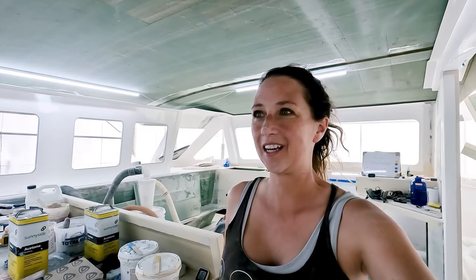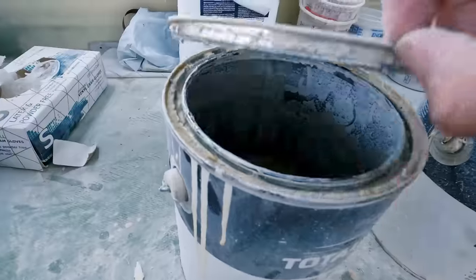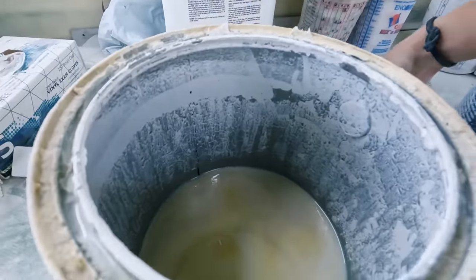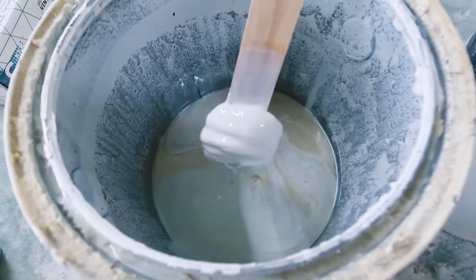Working through the hottest part of the day right now where temperatures inside the tent are 91 degrees, but the real feel has got to be like 10 degrees warmer than that, topping out over 100. But I am determined to get the primer on, so now that I have sanded all those areas and cleaned them up, we're going to put on our Total Boat two-part epoxy primer. That needs 15 minutes of induction time so I'm just going to mix up a couple of ounces since I don't have a huge area to cover.